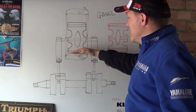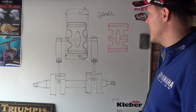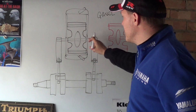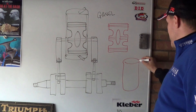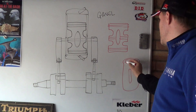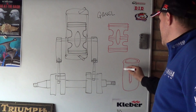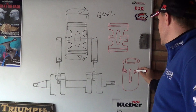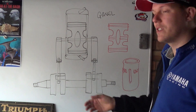The hole is just for lightness and cooling. What happens is the piston here comes down. So what we have is a rod going through the piston, which means that the cylinder has to have a slot in it. The cylinder also has ports in it that go here, somewhere like this. The CAD drawings show it better. Top and bottom - so the whole thing is symmetrical.